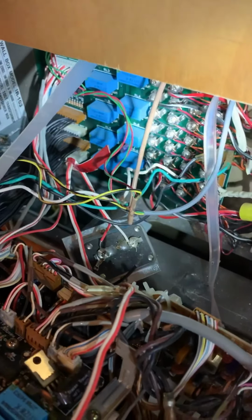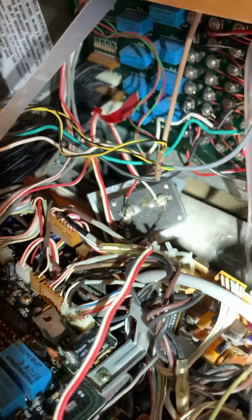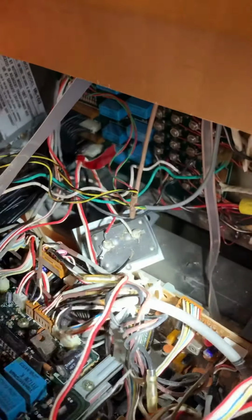So what I'm going to do is use those two wires that were going out to the speakers and power, and connect them to the power adapter. Then at the front door, I'll have the power coming in, which I can connect to the Ring 2 doorbell, hopefully. This power supply, I'm not really sure how much power is going out there, maybe 15 volts or something. What does it say? 6 volt, 16 volt? 16 volt, yeah, okay. That might be too little, but we'll give it a try and see if it actually charges the battery pack at all. It may be a moot point, or I might have to switch out to a 24 volt power supply if that doesn't work, just so I won't have to change the batteries as often.